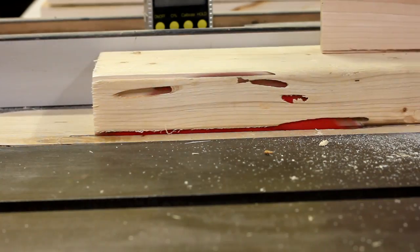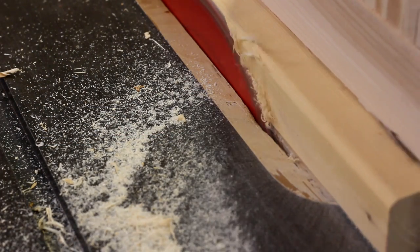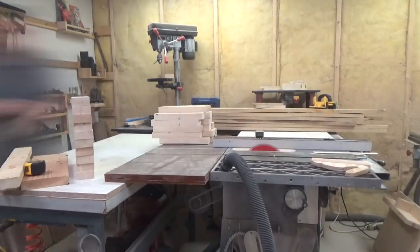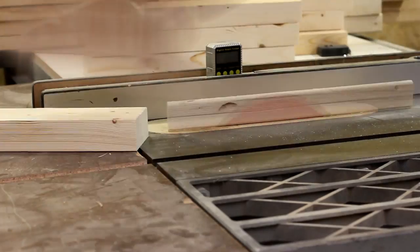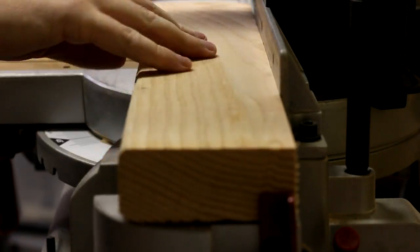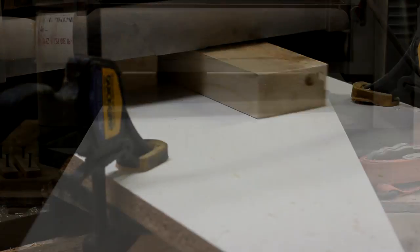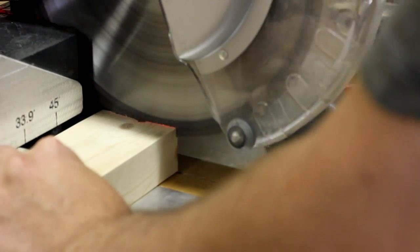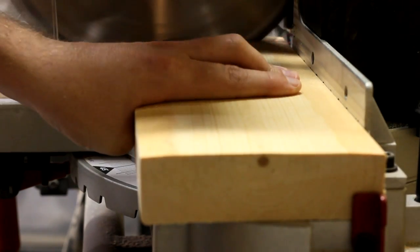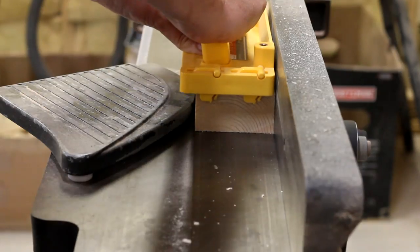Now it's time to move on to making the brackets. I start by ripping off one of the rounded edges of a bunch of 2x4 pieces. Ten brackets made from three boards each makes for quite a bit of cutting on the table saw. But once they're all prepped, I set the fence to three inches and run them through again to get them to their final width. Then over on the miter saw, I cut all the outriggers to their final length and get them all cleaned up to the same thickness over on the planer. Now I can start prepping all the bracket uprights — I set up a stop block on my miter saw and cut about a billion pieces to length, then trim them to width on the table saw. To square them up, I run each one across the jointer.